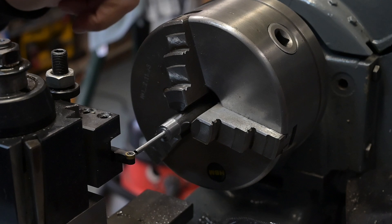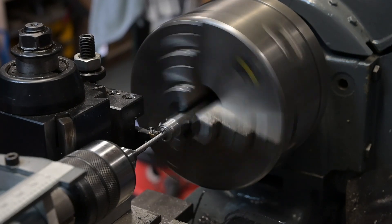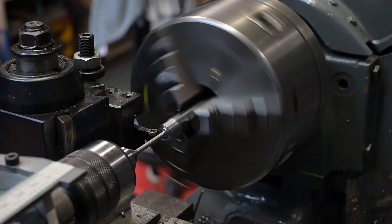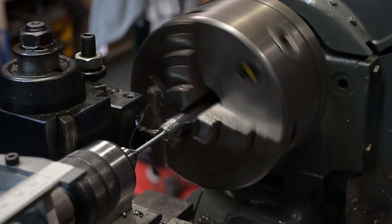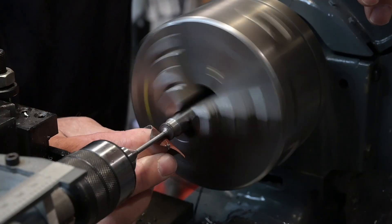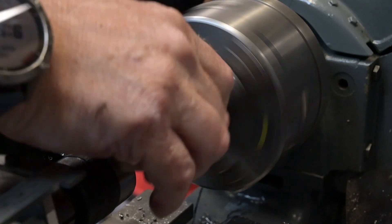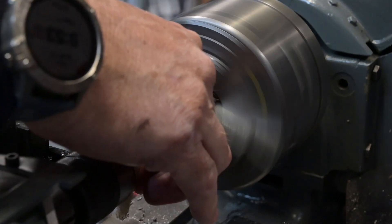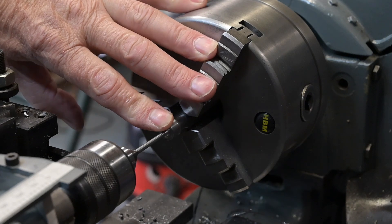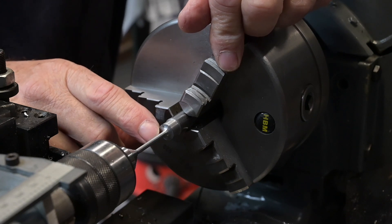Zero out the DRO — 1312 that way to form my round. It's got that little detail formed and now I have to create the chamfer on here for the valve seat.